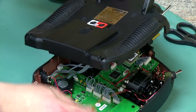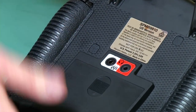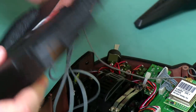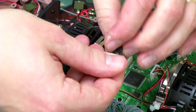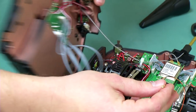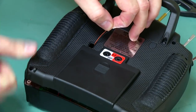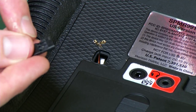Now we're going to figure out where to take our wire out of the back. Some people will use the battery door. I'm going to use this little rubber plug here — you can simply just press through the back and it'll just pop out like that. To get the wire through that hole, we're going to release the wires from the servo connector end by just lifting up the tabs and pulling the wires out, then fishing them through the hole. Now that our wires are through the hole, we're going to reconnect them to the connector.